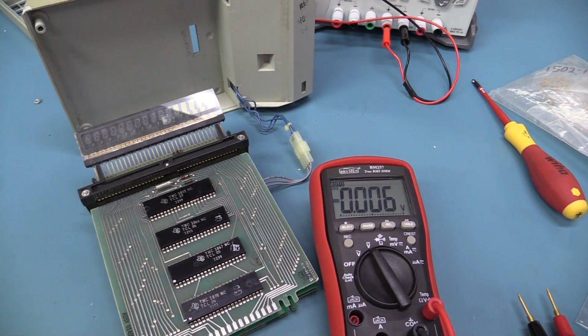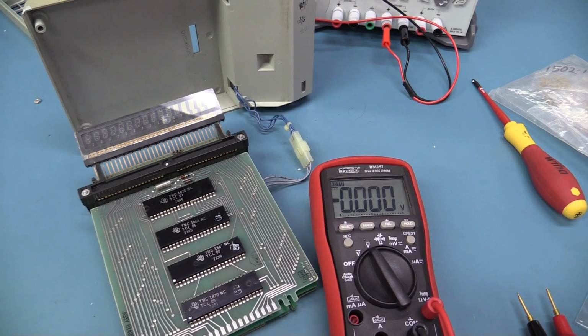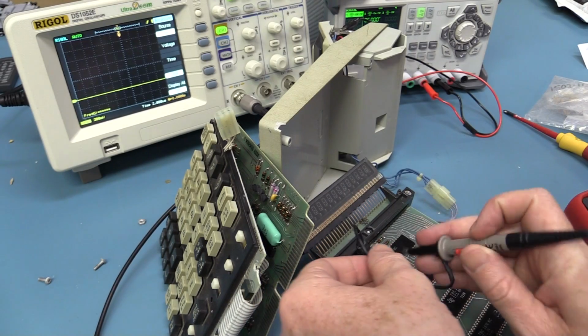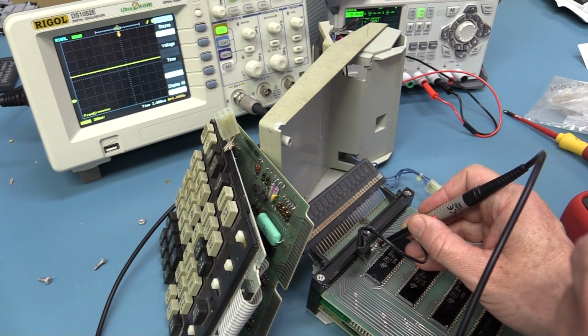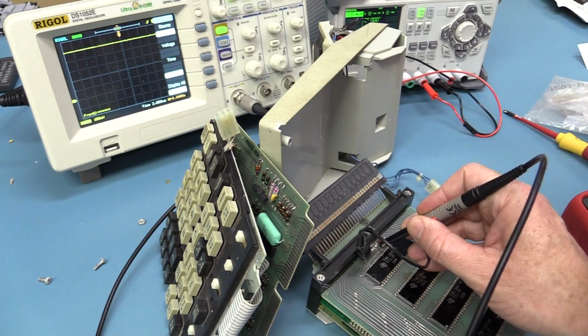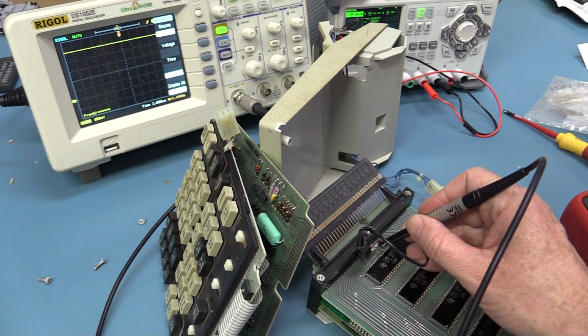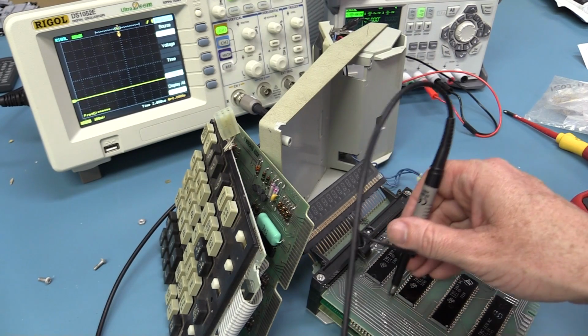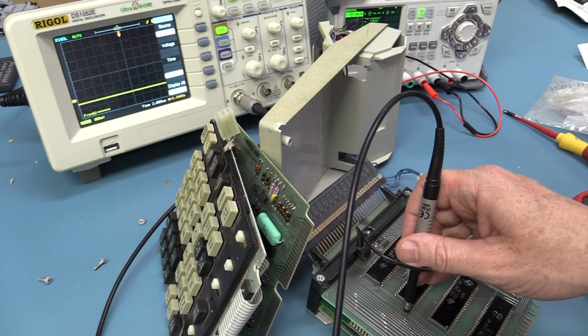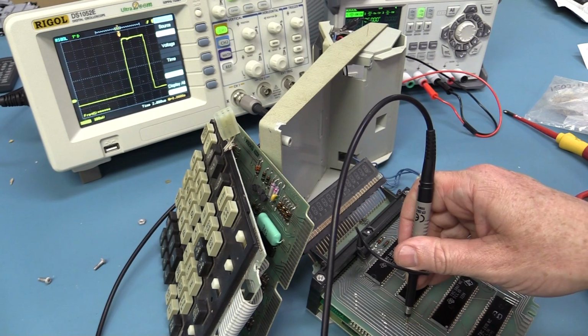So yeah, 5 volt logic, they've got 7400 TTL stuff in there, so they're going to have a 5 volt supply everywhere, you've got to presume, so that's okay. So all the logic is powered up. And if we have a quick little probe around here, there's our 5 volt rail, so that's doing hunky-dory, no problems whatsoever. There's no ripple on that, and we've got all this bus stuff happening over here. So let's start probing some bus.